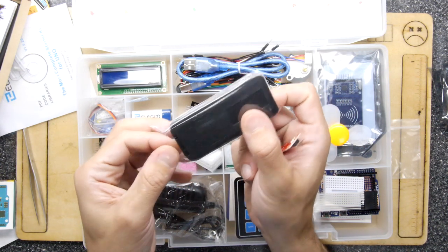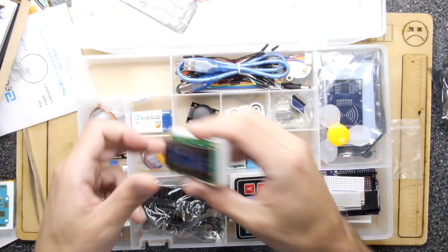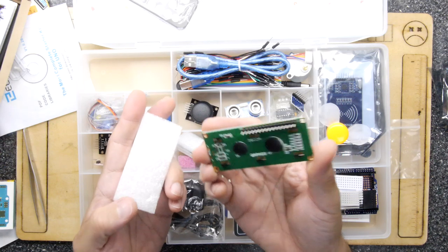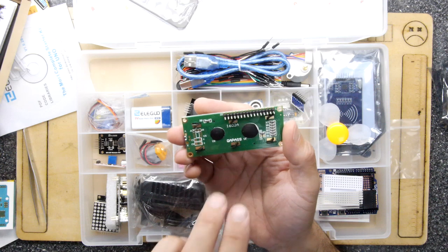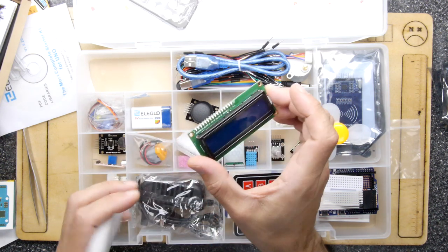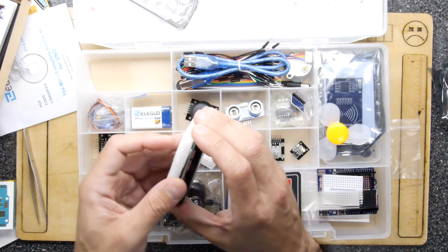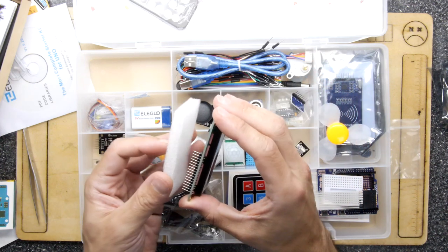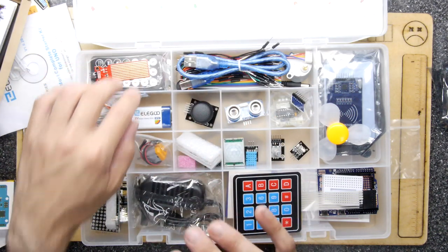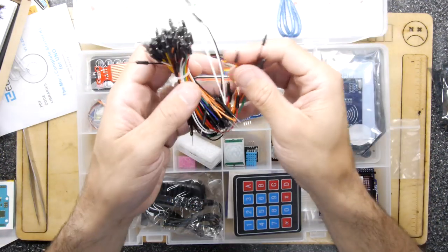There's a remote control with Elegoo branding, includes a battery with the plastic tab ready to go. You can program these any way you want to control your projects or make a little robot. There's also a screen — it looks like data is pushed straight through in parallel bytes, meaning you use a lot of I/O pins on your Arduino but you get a directly driven display. It's actually good that it's kept low-level because it's important to understand bits, bytes, and registers.